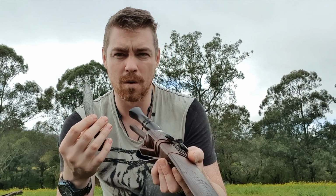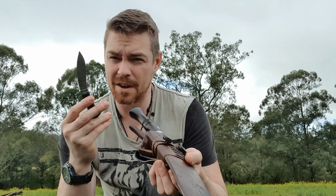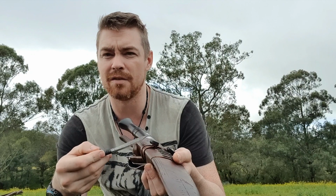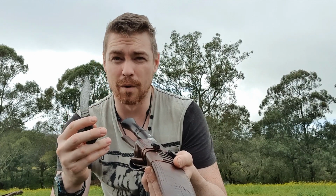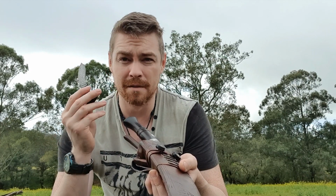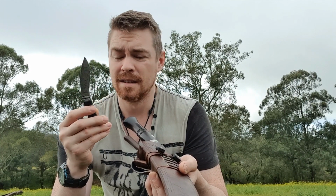along the side here. And what that achieves is actually really cool, because when they're perfectly flat, you've got to get right up near the tip when you're drawing it along your blade to maintain contact with the blade for honing. This one, because it's got that very slight curve, it's a lot easier to keep a piece of that edge in contact with the edge of the Khukri all the way up and through that recurve. So that's really cool, and it's the first time I've seen that. So I don't know if it was a fluke or not. Barun, keep making them like this, mate.